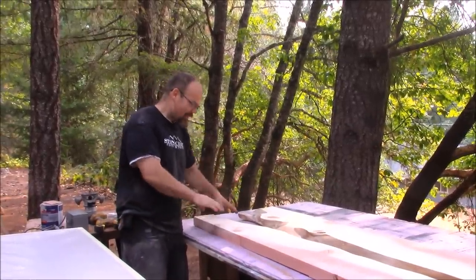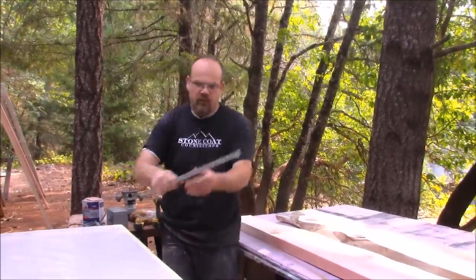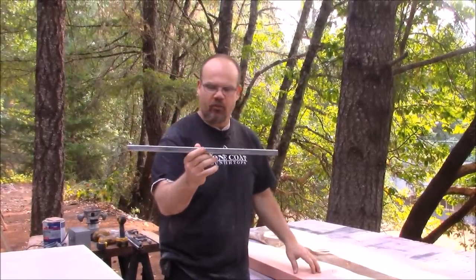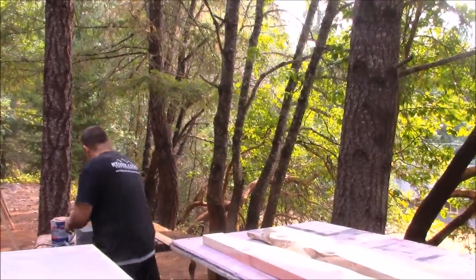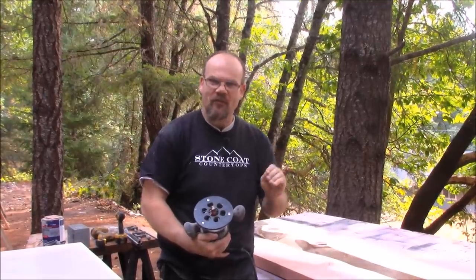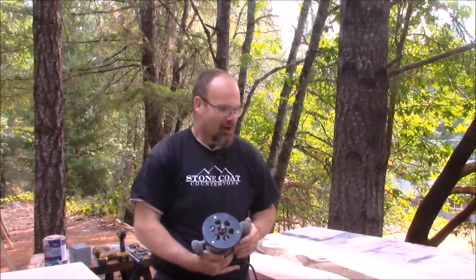We got these redwood pieces cut and flipped. I really like how this river is going to look through here. What we're going to do now is transfer these pieces onto our bar table — flip it upside down and install reinforcement bars. These bars will hold it steady, keep it true, and make it very structural and sound as we pour our epoxy. We're using three-quarter by three-quarter square tubing, and on our router bit we're going to use a seven-eighths inch router bit, which gives us a sixteenth on each side of the bar for bondo clearance.